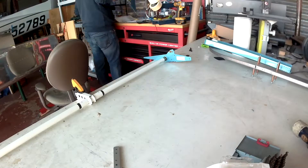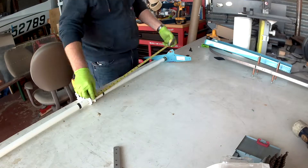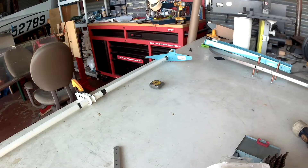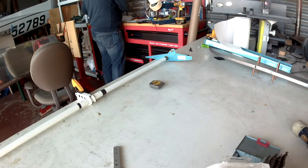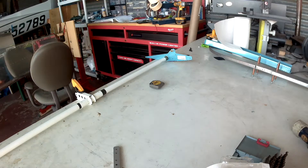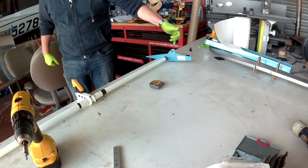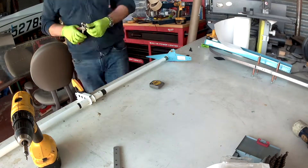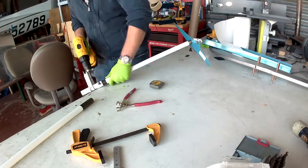You have to shimmy it — kind of minorly adjust it so it's just the right length, which you can see me doing there, which was 23 and 5/16 inches. And then with that in place, you are free to drill the hole in the center. Once both of these are attached, we're going to grease them up and shove them into the plane. In the next video we do just that — I bolt everything together and we shove it into the plane.